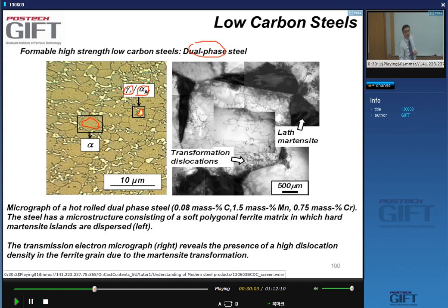So in principle, when you see a micrograph, unless somebody's told you what it is, or unless you have analyzed these particles yourself, it's just a micrograph, right? These little yellow particles are yellow particles, right? So they could be austenite, or they could be martensite. So in general, I can't tell that this is martensite. Just as much you can't tell it either. You need more information.